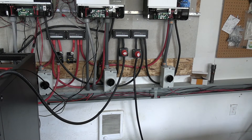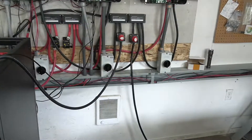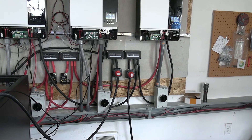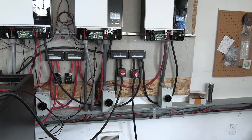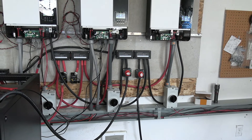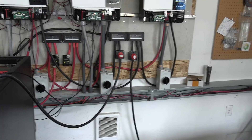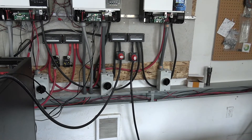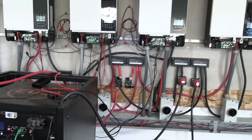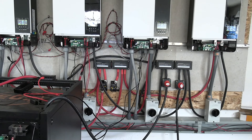When we get the new batteries we'll go ahead and hook that up and then we'll have more batteries. When we do hook that up, I'm going to make sure these are at a hundred percent first, then hook up so I only have the two batteries charging from solar, with these shut off, to get them up to a hundred percent. Then we'll hook everything all up together.